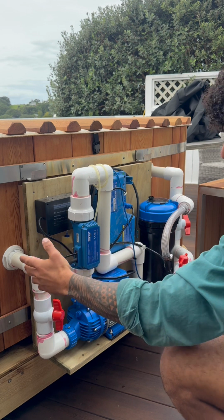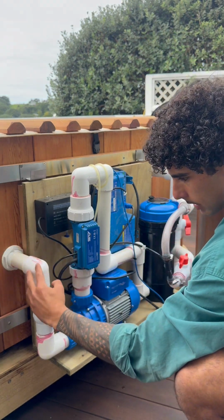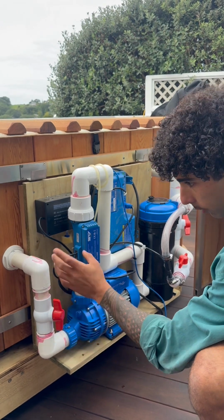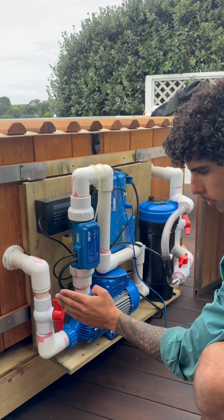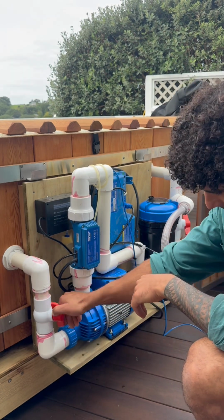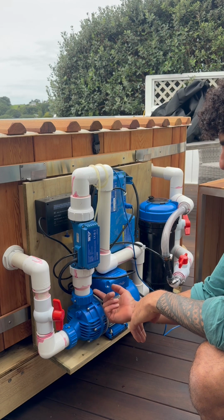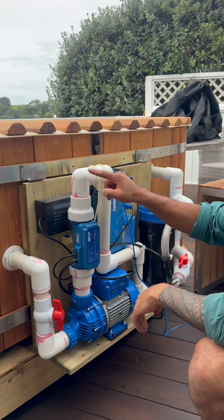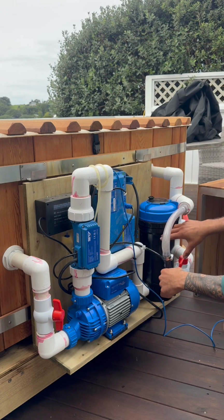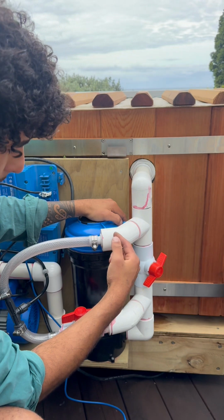So first we have our water inlet, so this sucks the water in the tub. We come down here to an isolating ball valve that we can close off. Vertical is open, horizontal is closed. The water here comes into our circulation pump, up through the heating element into our filter housing, where it is then filtered. The water exiting the filter up into our venturi system.